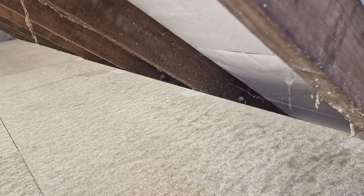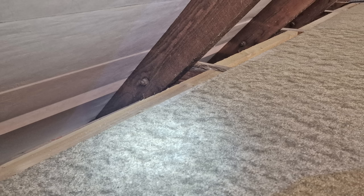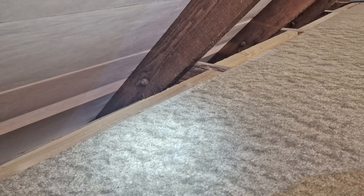Had I planned this better I could have equalized the gap at both sides of the room, but instead I've got no gap on the original side apart from that 10mm expansion gap, and too wide a gap where I end. Which means I either have to put in a fiddly little strip incorporating a tongue and groove — which will be a lot of wastage — or just make do with the gap I've got and move those noggins further back to support the end of the board.